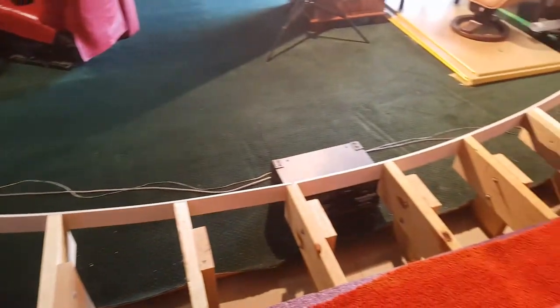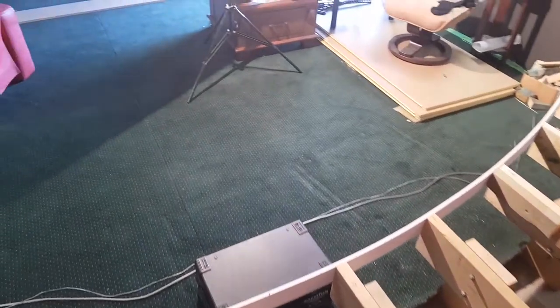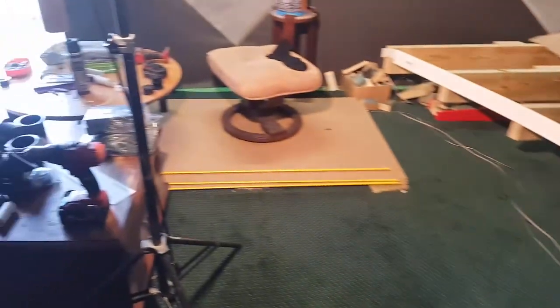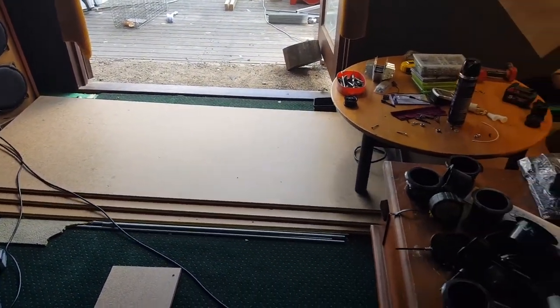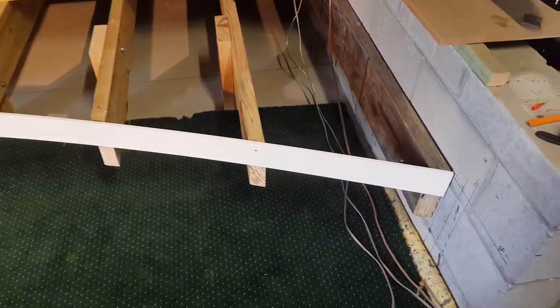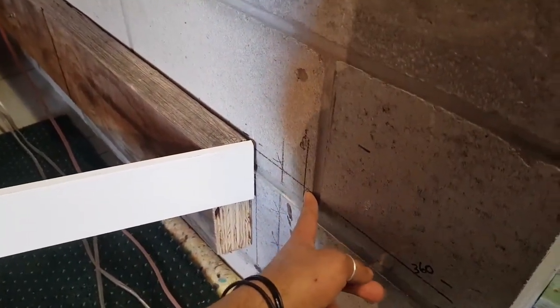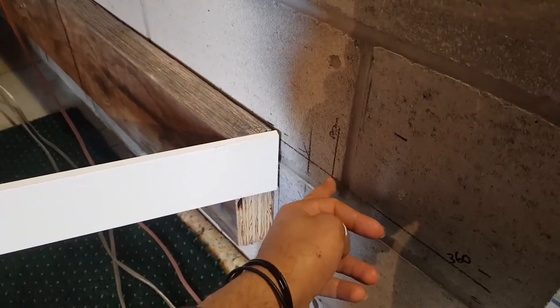So cool. Now, I'll tell you some of these problems that I'm coming up with. Basically, what you kind of think you would do is you grab one of these sheets of flooring over here. This flooring here is 800 mil wide and they are 3.6 meters long. Now, what you'd think is you'd just grab one and stick it up here. I think I'm having 80 mil overhang, so it has to come out to this point here because this is going to be an overhang. Lights and things are going to go there, so it has to come out here. So you would put it here, right?